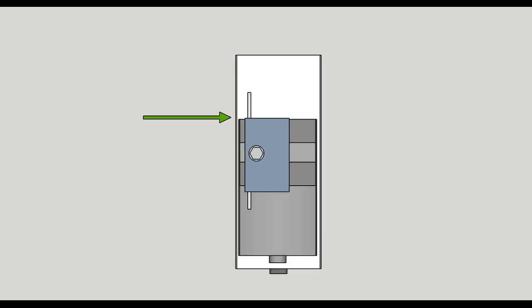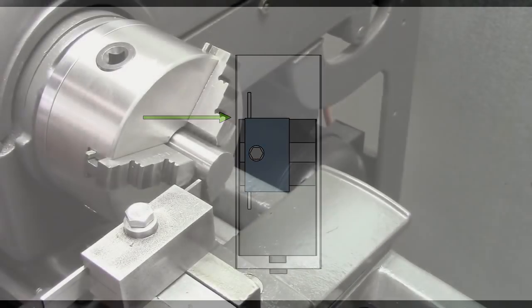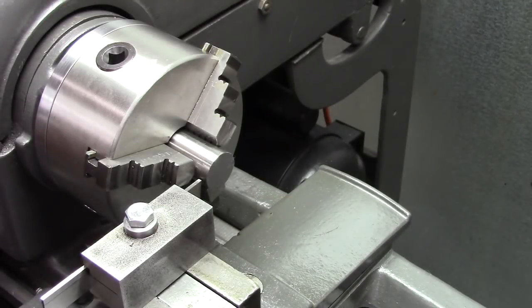Let's get on with building the tool and demonstrating it and discuss more about resonant frequencies. I've got a one inch bar chucked in my lathe, and the surface speed calculation works out at about 480 rpm — that's what I've got the lathe set at. But I've done a little experimenting here and realized this is probably not going to work very well. It'll work, but it's not ideal.